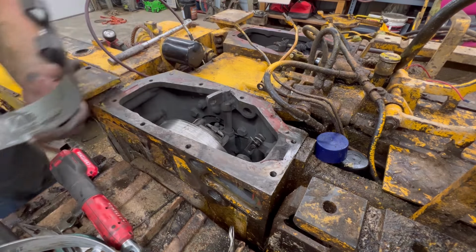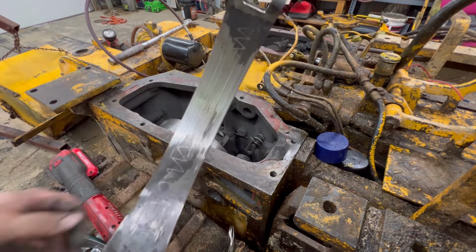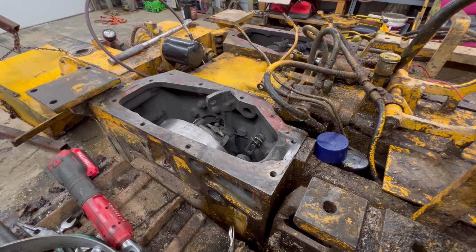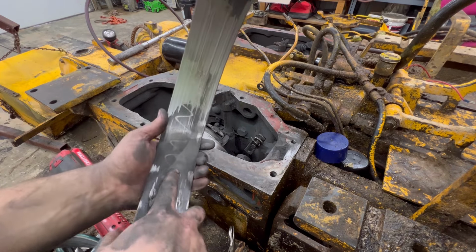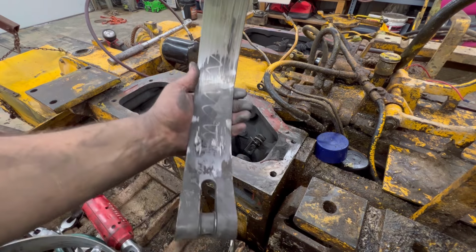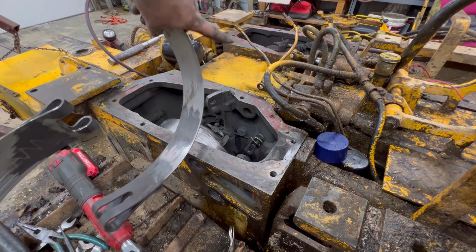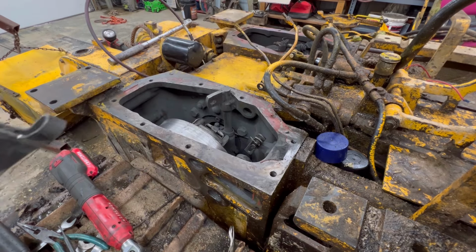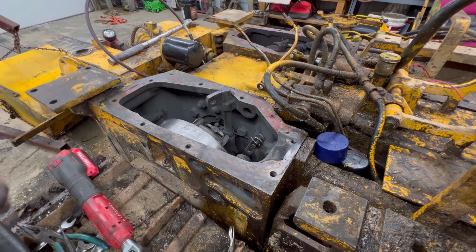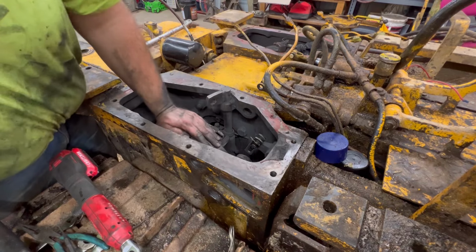There we go. Here's the brake band out of there, and that's my issue. You can see whenever they glued those pads, look, all they did was run the grinder there like that. So both of those broke loose. That's why that side over there has already fallen apart too. I'm just lucky it's not like this. It was still kind of working because the pad actually stayed in it. So I'm just telling you now, this drum is toast.